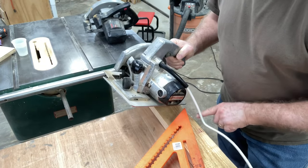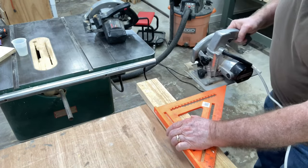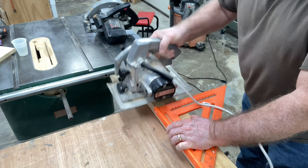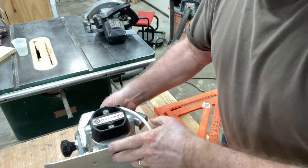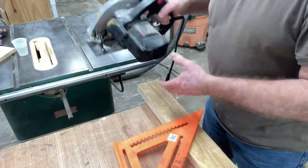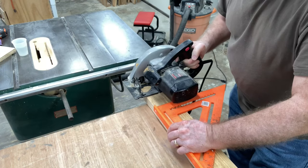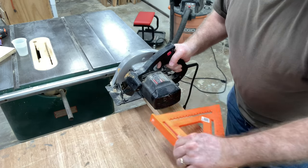One of the very common ways people use to cut a straight line with the circular saw is to use a speed square. This speed square can sit right on here and gives you good support before you even get to the wood, and you can make your cut. Before I started the saw, I actually looked over on the right-hand side at the blade before turning it on — it's just out of habit. This saw was designed with plenty of room to allow for that. When I pick up and look at this newer saw, it's designed completely different. This area here is very, very close to the bottom of the motor and will not allow me to push through — so this technique would not work with this saw.